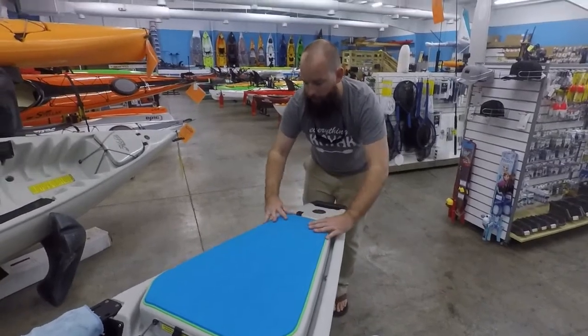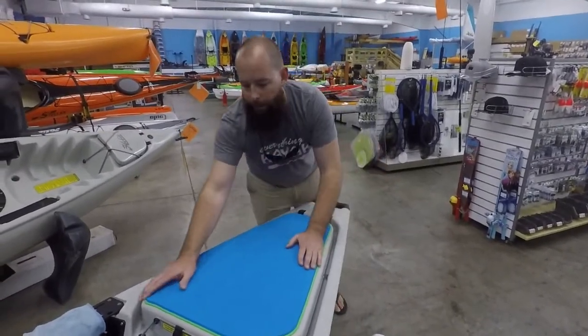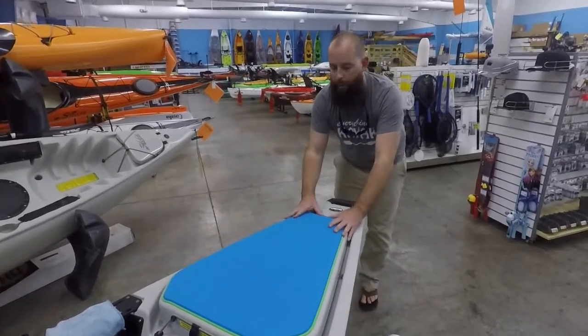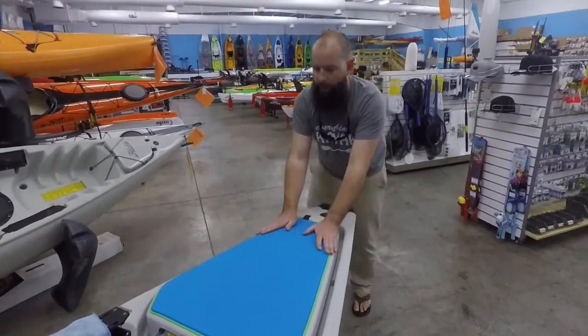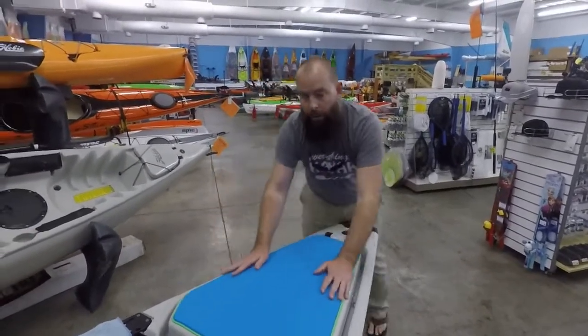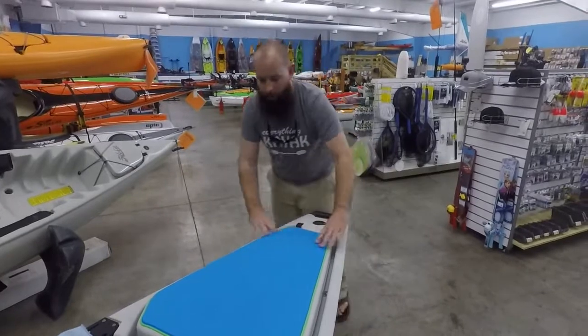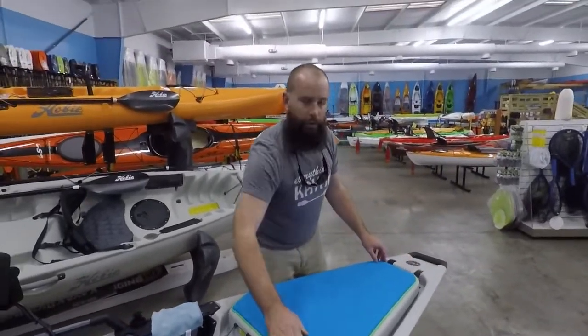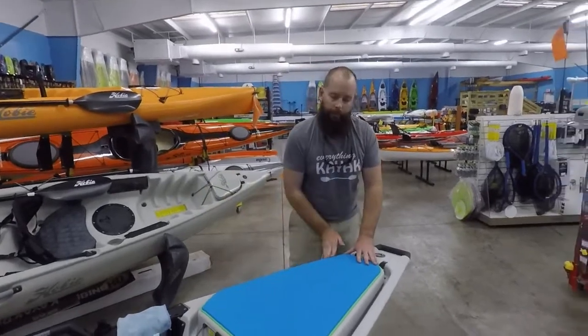We'll suggest you keep an eye on it. If you're going to apply like this, don't throw it in the back of the truck or load it up and haul it — give it some cure time. You want to make sure you're not going to get any peeling up, especially if you've got a lot of moisture outside or really humid areas where it's been raining. You want to make sure you're not going to fight into that, because traveling you're going to get some intrusion under there — make sure it's perfectly cured before that.